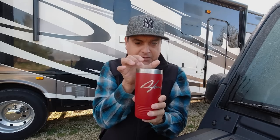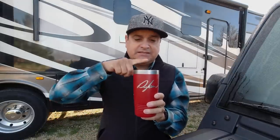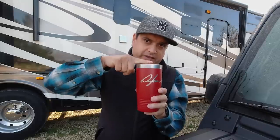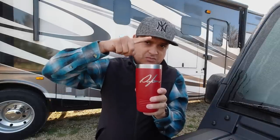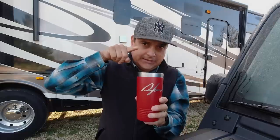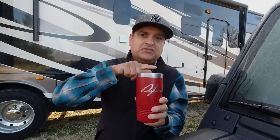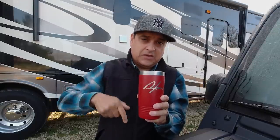So the diameter of the magnet, the length of the magnet, the gauss of the magnet, okay? And then also the distance that the object is away from the magnet, so the distance that the string is away from the pickup, right? Also, the diameter of the magnetic thing, so the diameter of the string in relation to all of that, okay?